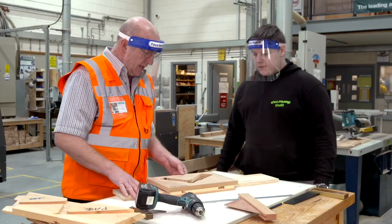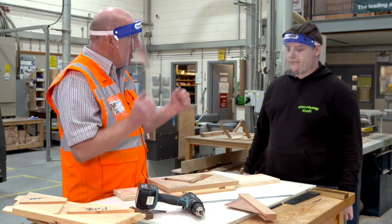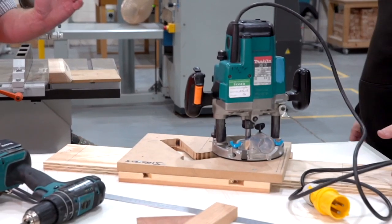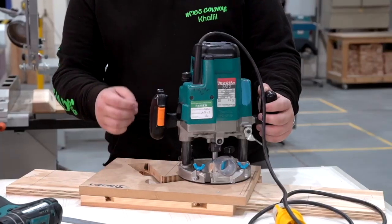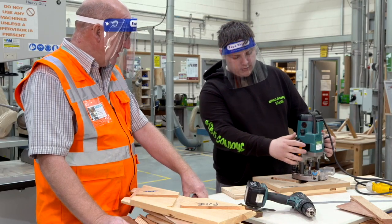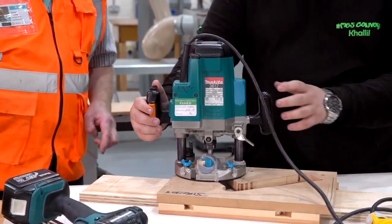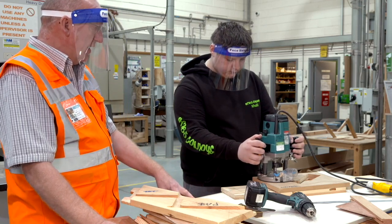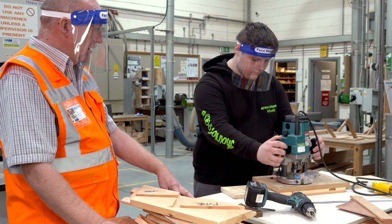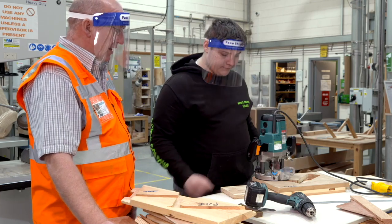So we put it in place. If you think on your staircase — if you walk up your stairs you can't see what's happening round the back — so we'll actually put a screw in there and screw it on each time, then get our router on it and run the router round. Show me what you'd actually do — we know it's not plugged in. So we pull this down and start it up and then we go around. So where would we actually start? You start off the material, plug it in, and then you need to run round that direction — you always run round it clockwise. Just run it all the way round, get the feel of running right round the jig for yourself. Absolutely spot on, well done. And we'd simply repeat that every 150 millimetres.